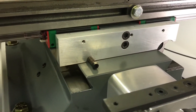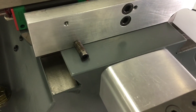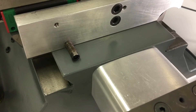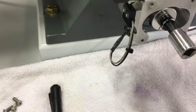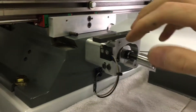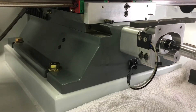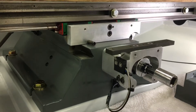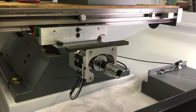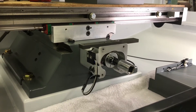What I came up with is a number eight cap screw. I put it in a 5C collet holder, put it on the surface grinder, and ground about 20 to 25 thousandths flats on the edges. The spring keeps it from adjusting itself, then it comes and trips on the switch. I'm going to put some slots here so you can adjust it up and down, and adjust this in and out. We'll see if we have any EMI interference with the home switch and motor being so close.